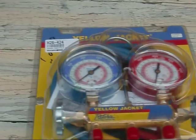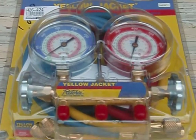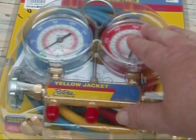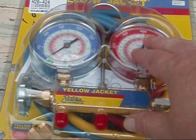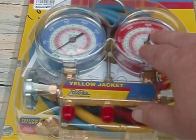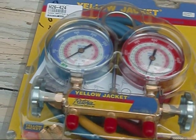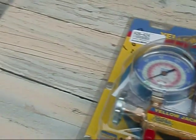While I was out, I went ahead and got a set of Yellow Jacket hoses too. A lot of times I might have to leave the job and I don't want to lose these — better than getting my Testo stolen. What I'm going to utilize these for is virgin refrigerant lines only. The system doesn't know whether it's R-22 or R-410A if it hasn't been opened yet. If I'm changing a compressor out on old lines, I'll pull out my old set of gauges for that.